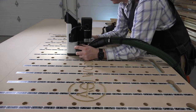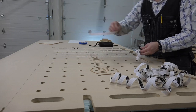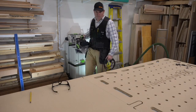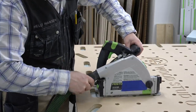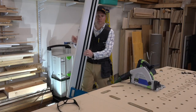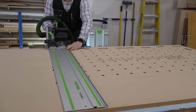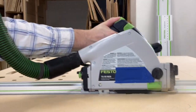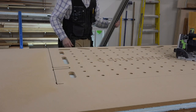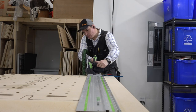I customized my multi-function slab by adding my AG Wood Studio logo to the top. Origin can also be used for engraving — I simply imported my logo and set the cut depth. I went a little too deep at 4mm and would recommend 1.5mm or one-sixteenth of an inch. Now that I'm done I can remove the Shaper tape. I only cut a small length at the corners to mark each of the edges and I'm going to cut the top out using my track saw. If you notice, the two sides have a rounded notch — one to hold the 27mm Festool hose and the other side holds the 36mm hose.